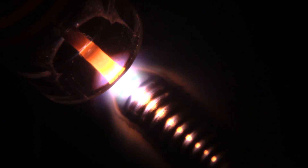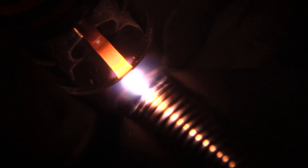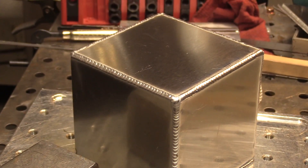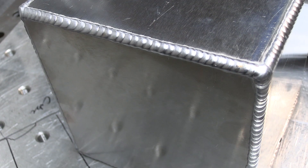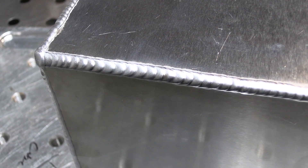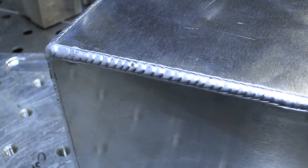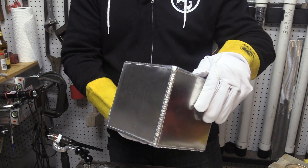Getting close to the end of this cube where all the welds are pretty much done, and that's where that vent hole I left in there to begin with is helping. If you've ever sealed something up before, gases expand inside and it'll just blow the weld out and you've got a mess. Sometimes you can drill a hole — just leave it somewhere easy to get to, and once it cools I'll just zap it and pack rod in there really quick to seal up the hole.